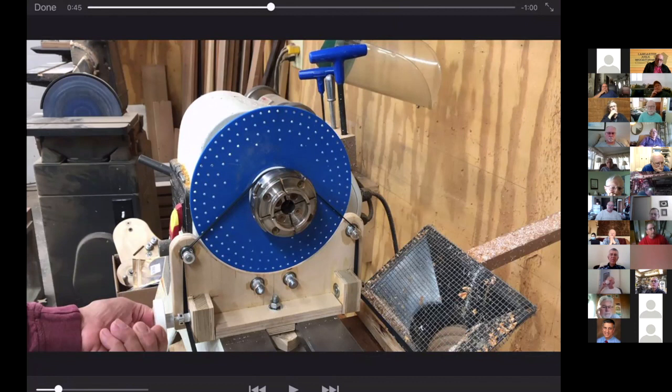But once the shaft is through, I just put a drop of this super gap filling CA, and it behaves just like Loctite. Barry, the shaft is permanently, well, semi-permanently in there. The shaft can't move with respect to the inner race of the bearing, and that's fine. So the bearing is engaged throughout the rotation.